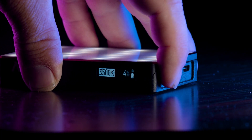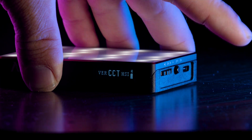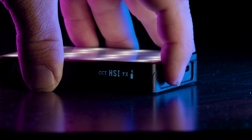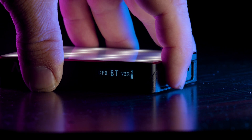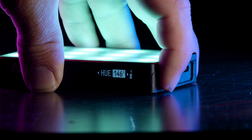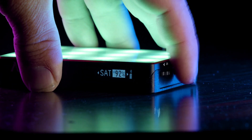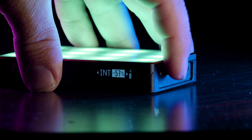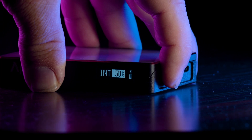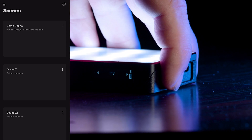The MC has many different modes aside from CCT. To access another mode, press and hold the click wheel down, then use the wheel to cycle through the menus: CCT, HSI, FX, CFX, BT, and VER. Selecting HSI lets you dial in color based on a 360-degree color wheel. Clicking once pulls up saturation, and clicking one more time lets you set intensity. For all effects and effect presets, you can only dial in intensity on the unit itself, but you have more options within the Sidus Link app, which we'll look at a little bit later.